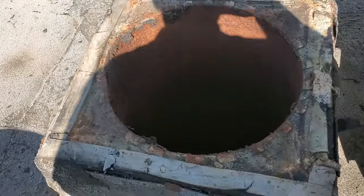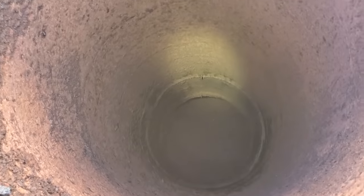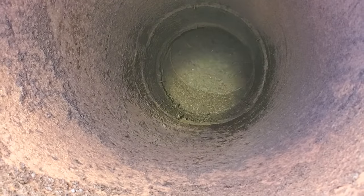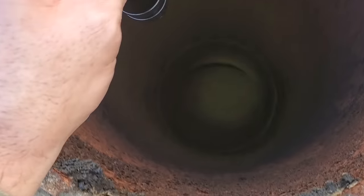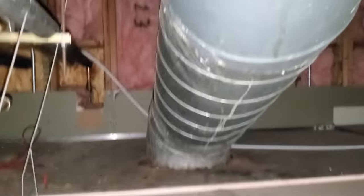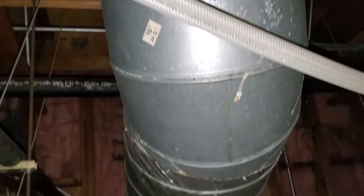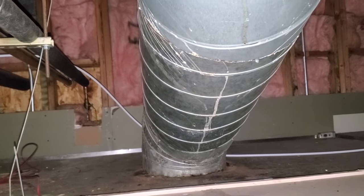You can actually see they've been having rust problems for a while. I pulled the ductwork off and pulled the fan off — look at how rusted out this is. It doesn't look like it's got a hole in it, but I want to know when it makes that turn if there's a hole somewhere. I got up into the attic — there are no holes in the ductwork, but it is certainly deteriorated. So maybe we just need to speed up that fan. The belt was a little loose, which is kind of strange.